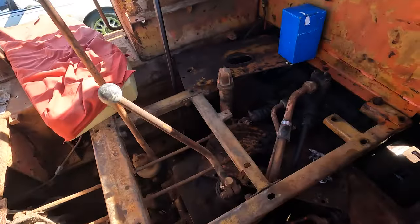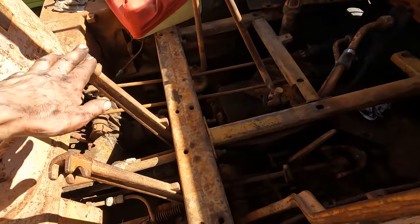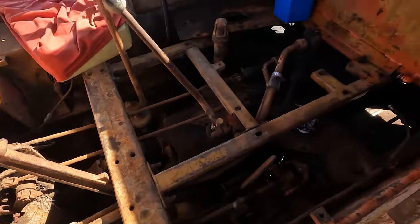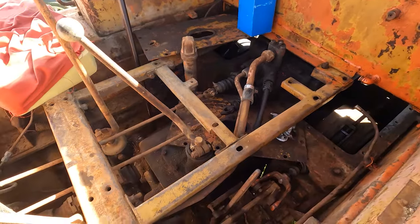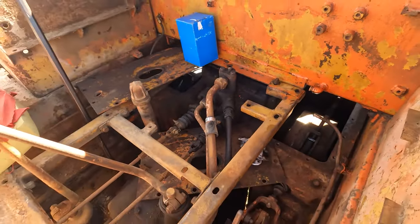I've got the other side off. I'm just checking that one out. That seems okay. I've just been adjusting these pedal heights the same. And then we'll just set the free play on the clutch band by adjusting that nut and get it all back together.